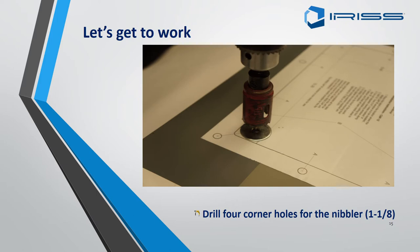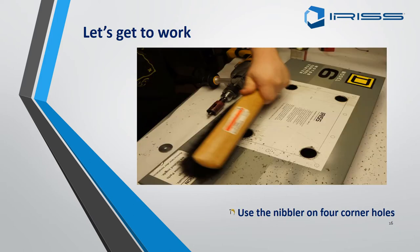For anything bigger — the CAP 24 and CAP 18 — drill the four normal corner holes but also add holes halfway along, top and bottom, so when using the jigsaw or nibbler you have something to head to and do not have such a long draw to each hole. This is also a good time to use your hand broom to sweep away any excess swarf.